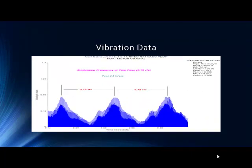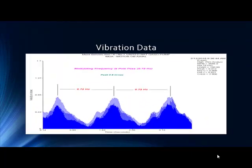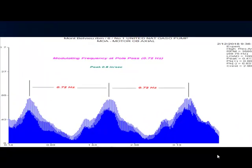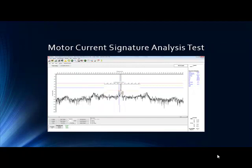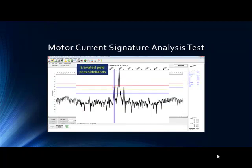The next sample of data is showing 0.72 hertz between the pole-pass modulating. This modulation is in the time domain. When you think of a modulating vibration, it actually shows it here in the time domain. And our current will do the same thing — modulate current at a specific frequency. So when we look at it from our perspective, now we've got vibration data and now we have current signature analysis data. Where vibration focuses on running speed, the current signature is going to focus on line frequency — in this situation, 60 hertz — and that same 0.72 hertz sideband that showed up in vibration is also showing up in current.